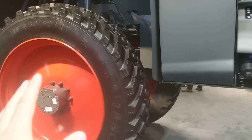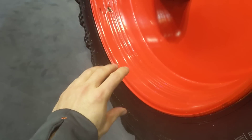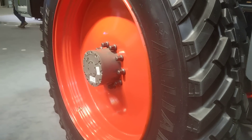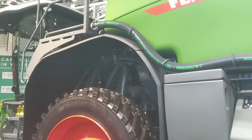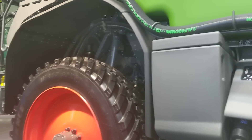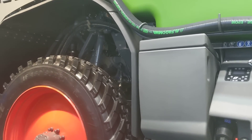So we'll start with the tires. You got the 50 inch IF tires on here. Can we lower the pressure to put a little squat on the tire? Yes, we can — not automatically, but you can adjust the tire pressure. And as everyone sees, there's a huge gap here. The sprayer's actually lifted as far as it would go. At this height it's limited to 20 kilometers per hour, and when you go to the lower height you can go 40 kilometers.